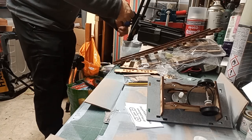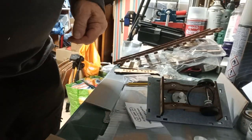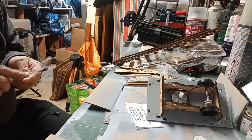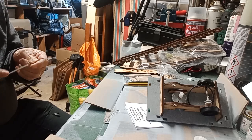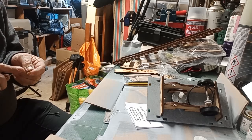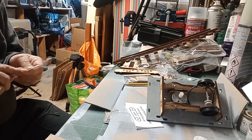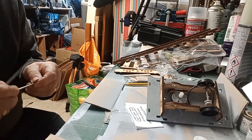Right, that's cut — though the blade may be getting a bit blunt, you can hear it. I'll use a file to take the burr off because if you try to push it into the wheel hole with the burr on, it'll be very difficult, and if you do succeed the rough edge will act like a drill and make the hole bigger. Once you've cleared the burr it'll be just right — not too loose, just enough to position it. Take the burrs off, make sure it's smooth on the ends.